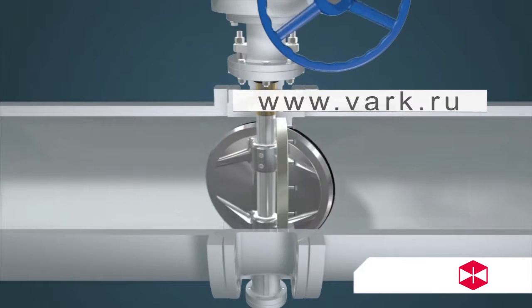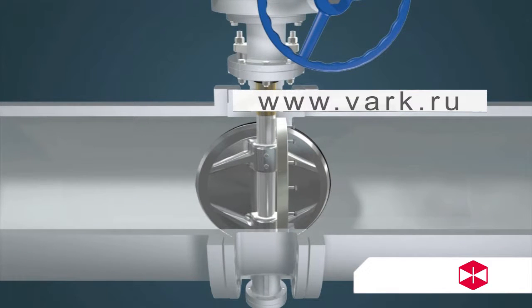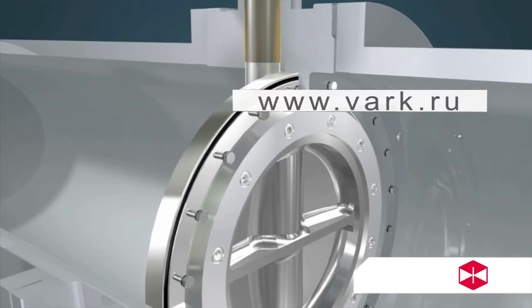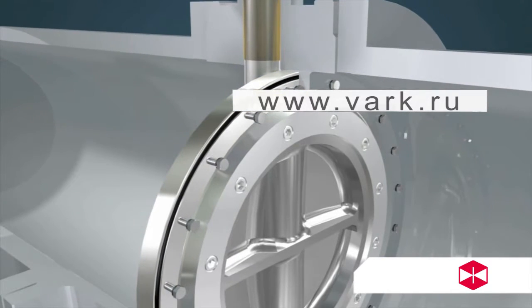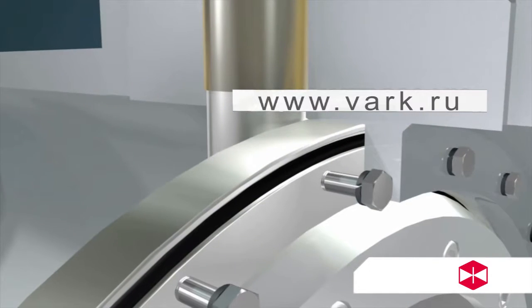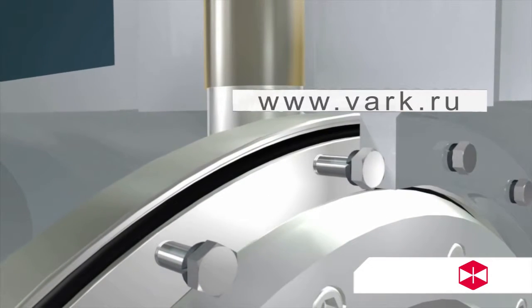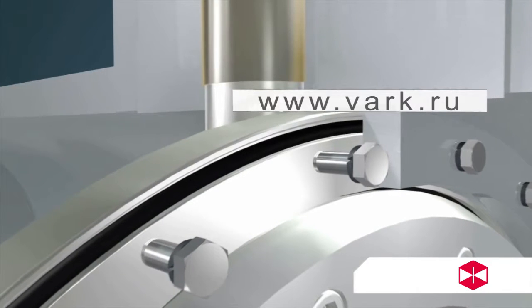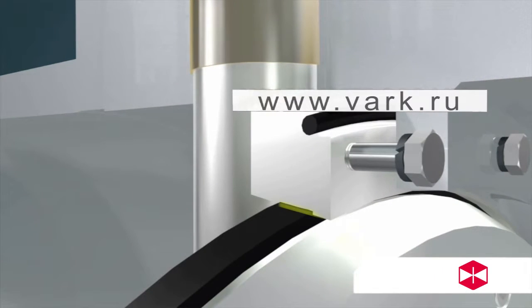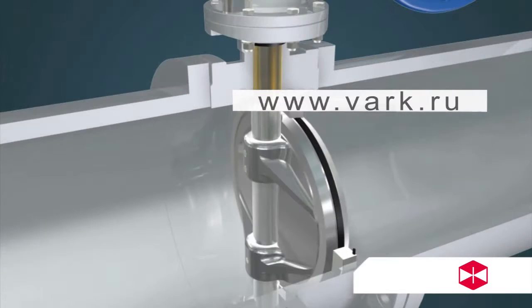The valve has a metal seat seal structure. The seat rings border on the valve body, and O-rings or flexible graphite gaskets are used for sealing. It also has a micro floating space. A hard alloy is welded on the valve seat sealing surface to improve erosion resistance and corrosion resistance, allowing use in high temperatures. The seal structure uses a bi-eccentric wedge design, so the valve seals tighter when greater force is applied.